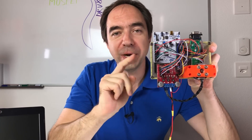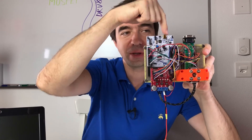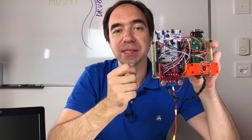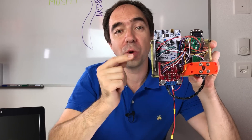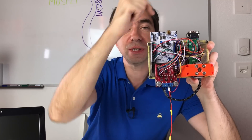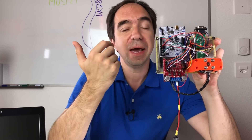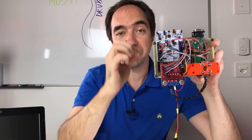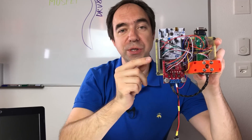This controller has two ways to communicate: the serial port and CAN bus. You use the serial port once to set up the maximum current, the CAN ID, calibration, and similar configuration. Afterwards, when all setup is done, you use the CAN bus to set position, speed, and to control the controller. So serial is just for setup; CAN bus is for when you use the robot.